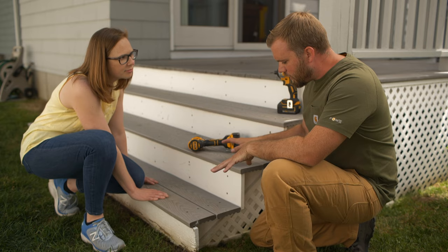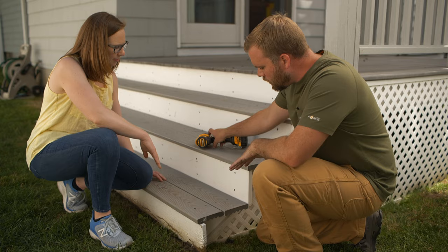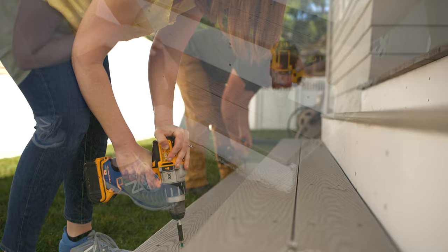How we're going to get started is we need to set our posts first. We're going to remove a few deck boards, take a look at the stringers, and see what's the best way to fasten to them. Luckily for us, your deck boards were actually screwed down with stainless steel screws — they're not covered with any bungs or plugs, so we can get right at them. A little trick for when you're pulling these screws: stainless is a very soft metal and it can strip out very easily, so you want to set your bit right inside before you ever pull the trigger, put all your weight on top, and slowly pull the trigger and start to back it out. That force is great to keep it from stripping out.